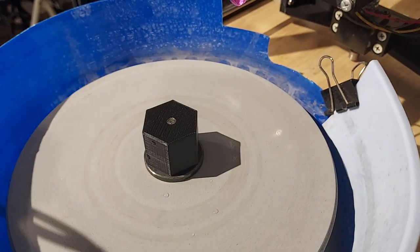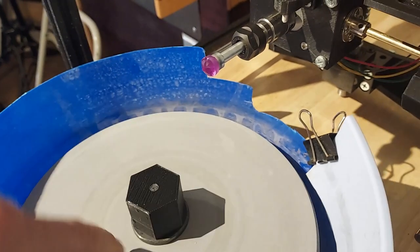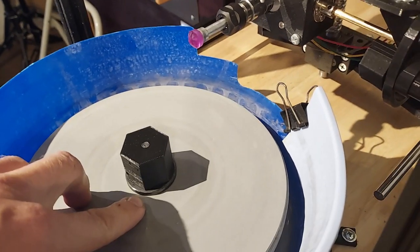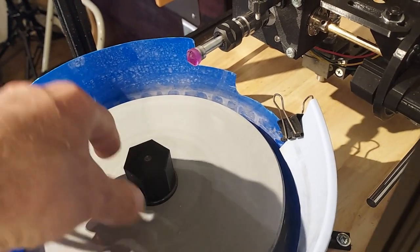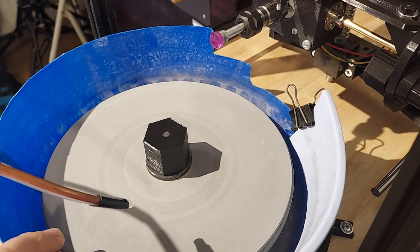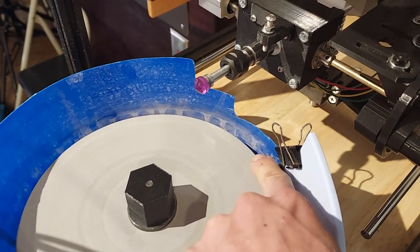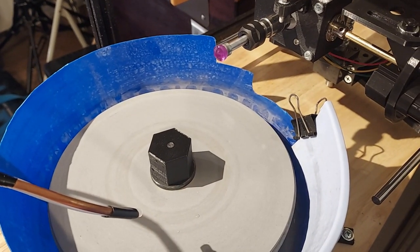The last thing I've done is put a washer on the top — this right here does have a nut embedded on the inside; this is a hand adapter. I put a washer here and then a washer on the bottom, and I'm probably going to upgrade both of those to maybe two-inch washers. That has really helped eliminate a lot of the wheel wobble I had before, because I was getting a fair amount of wobble at the edge of the wheel — or runout, if you prefer that term. By sandwiching the laps between two flat washers, that has made a big difference.